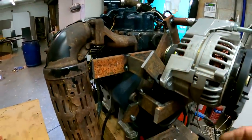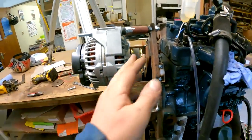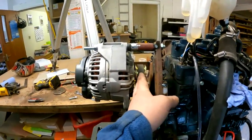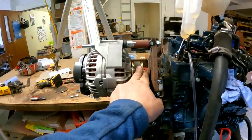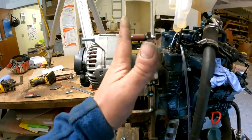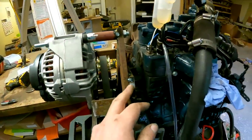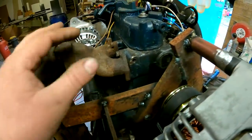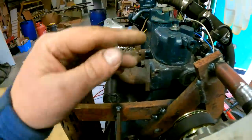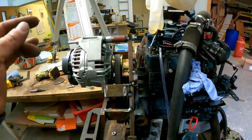The alternator is now hung. It doesn't look very pretty at the moment, but after we weld it all up and cut the excess off it'll be fine. Alignment wise it's quite good. I can shim the alternator pulley using copper sheet to get it right — it had moved over but I don't think I had it properly tight earlier, so that gave a false representation. It's parallel to the engine. I predicted we'll get some twist when welded, so I've welded a bar into the back here because we're making a heat exchanger — that gives us something to mount to rather than relying on the M6 bolts.